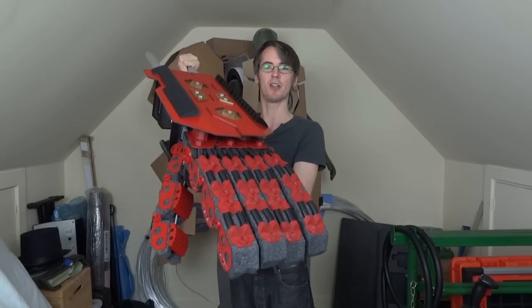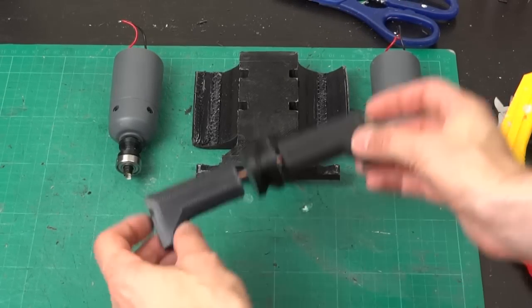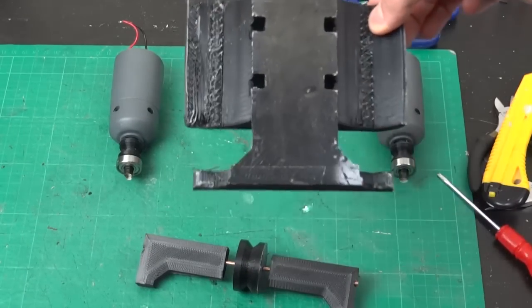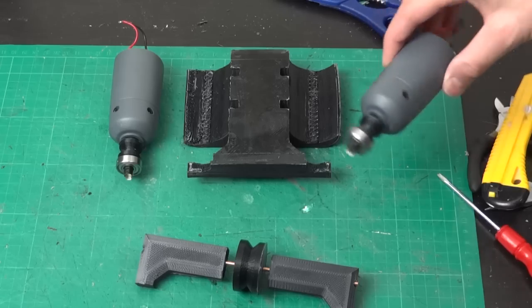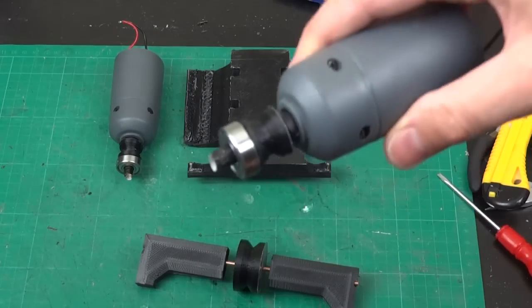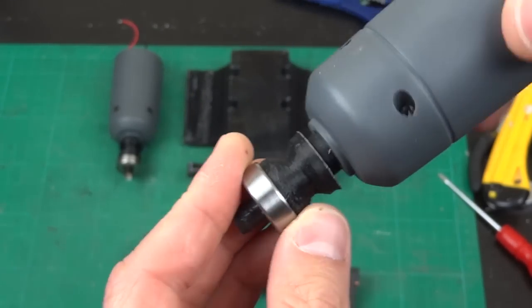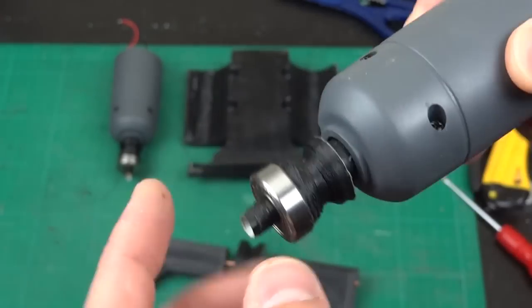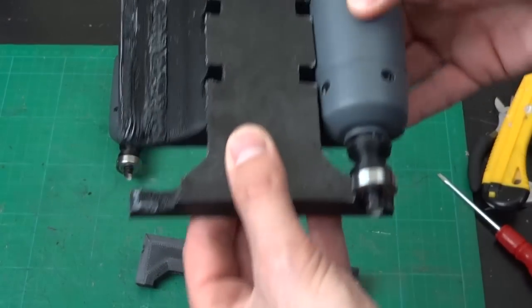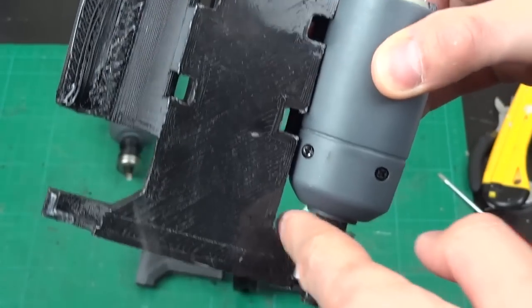What I've got here are some fairly uninteresting looking parts. I've got a piece there with a pulley in the middle, and I've also got this piece which mounts to these motors that I discussed in the first part. These are cordless screwdriver motors which have actually had the back of the handle cut off. I've 3D printed pulleys which are mounted onto the hex screwdriver bits, and on the other end is a bearing fitted onto the bit there so I can brace this across. It fits in here like so and will get cable-tied and glued in place so that a string can be pulled around this pulley.